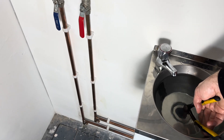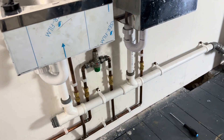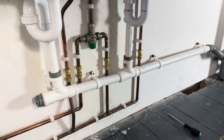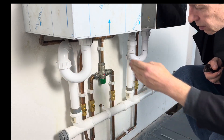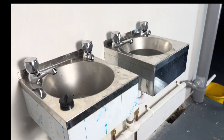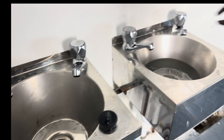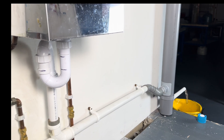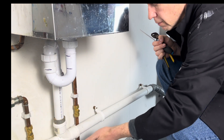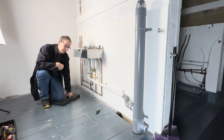I'm just going to check for leaks. We'll have a visual look for leaks — that's looking okay, just feel underneath, that's looking okay. Then we'll let the plug out of the second one as well, have a feel for any leaks — anything wet — and there isn't any. Now you know how to install push-fit waste pipe — it's your turn to have a go.